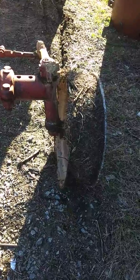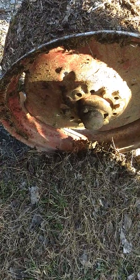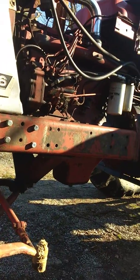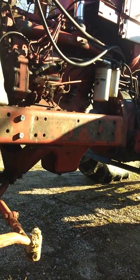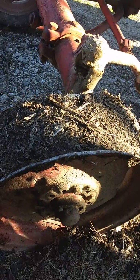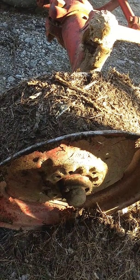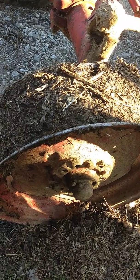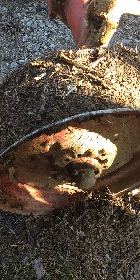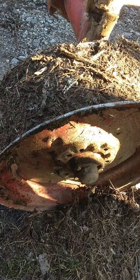Now, these tires that are on it are 6-bolt hubs, and they're narrow. These were 7.5 by 20s, which after putting the big old diesel engine upgrade and frame rails and what have you in a gas tractor, it was way heavier. So even just completely dry ground, you know, trying to cut hay or ted or any kind of hay, just driving across a field of grass, you're leaving ruts even when it's completely dry. I mean, not ruts, but it would sink in an inch or two. Turning, it would scuff the grass off the surface of the dirt and everything.